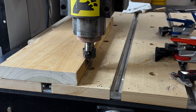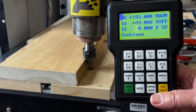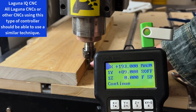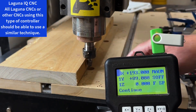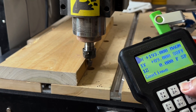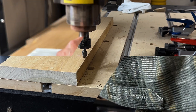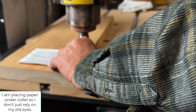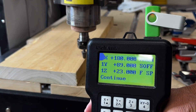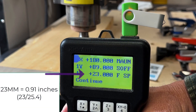For me, the most accurate way of measuring this depth to program into my software is using my Laguna handheld controller. I've zeroed the bit at its current location. The next step is to raise the bit up and have the bottom of the bit touch the surface, and that will give me the actual clearance. I'm a little too tight, so I'll come up one millimeter. I can see on my Laguna controller that my depth of cut where I won't hit the collet for my dish would be 23 millimeters.